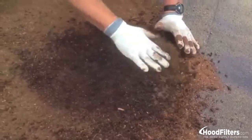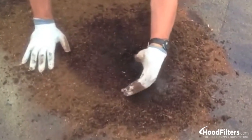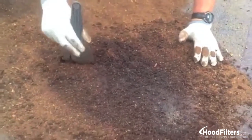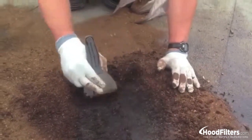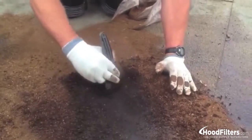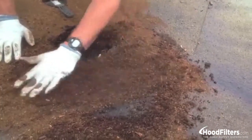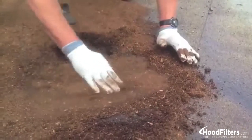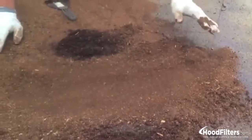What I wanted to show you here is when the oil absorbent gets enriched, you'll see it start turning colors and turning more into a solid. A lot of times when we're doing these, particularly when there's a lot more liquid, we'll rake back. These roofs get warm and hot. We'll set this off into our trash pile. The end result we're looking for when we get done is to leave a fine layer of absorbent about an eighth of an inch thick in the area — when we get done, that would be considered done.